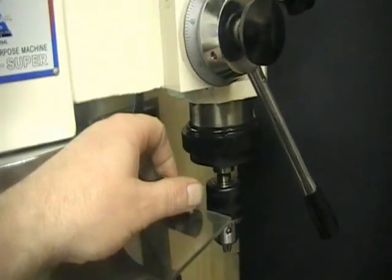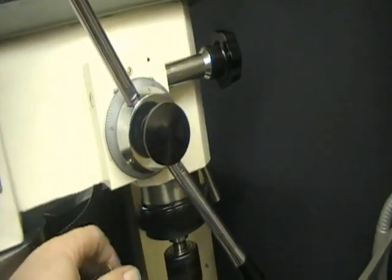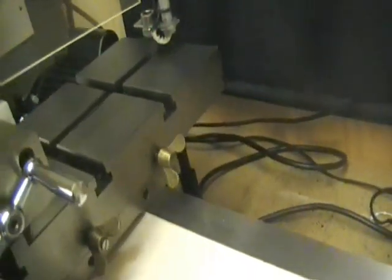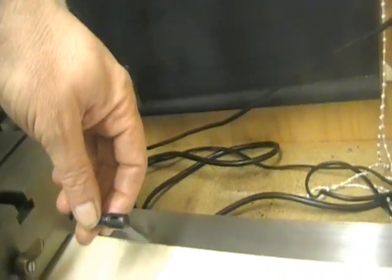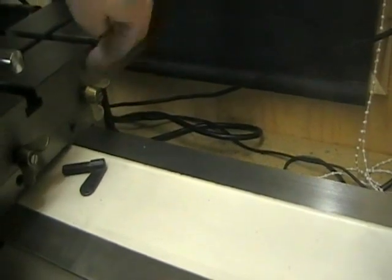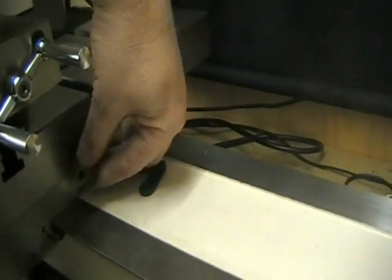A few little mods I've done as well — a wing nut on there instead of using the Phillips screw. I don't know how they expect you to get a screwdriver in there while you're working, so I've done away with that and use the wing nut instead. Same again on the slider — they use these little what I'd call a flying bolt, with a little wing on there. The trouble is they catch on the bed when you're sliding the slide back, which tightens the cross slide as you're moving it. So I've done away with them and I'm using wing nuts instead.